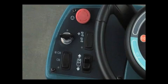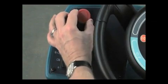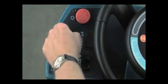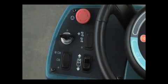The power kill switch stops all power to the machine. Press the switch to stop the machine power. To restart the machine, turn the power kill switch to the right and release it, then cycle the key switch off and then on again. The power kill switch should only be used in case of an emergency. It must not be used for normal stopping while the machine is moving, as this may damage the machine.